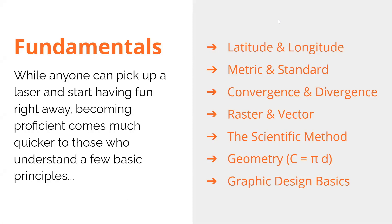Here are some fundamentals — anyone could start having fun right away, but to really become proficient there are a few basic principles you have to go back to. Latitude and longitude — your X and Y coordinates — is pretty important. And metric and standard: there's a lot of stuff that's in millimeters that I think should stay in millimeters. I was always used to standard, like everyone else used to inches and feet, but that's really not practical when you're doing such small detail. It's easier to say one millimeter than point-whatever inches. It is an interesting transition, but it totally makes sense once you start working in it, and you can still work in both.